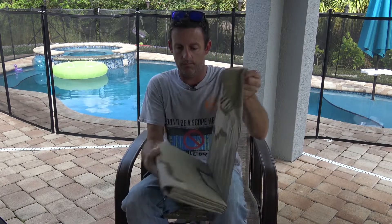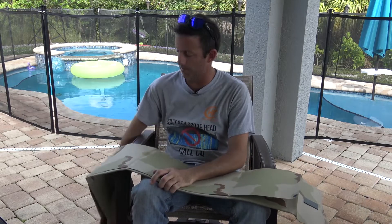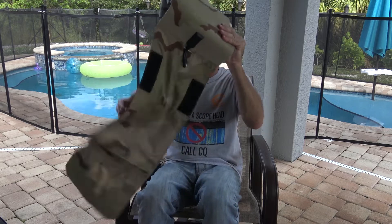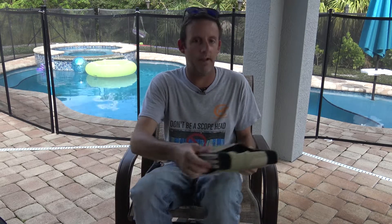The highest I've seen on that little panel with the sun here in November was about 3.1 amps. What I want to do is get one of these for my foldable solar blanket that I've used before in my QRP kit — a Global Solar panel that opens to about 65 watts with an open circuit of about 24 or 25 volts. That's on my wish list for portable operations, because that Samlex panel is a bit heavy.